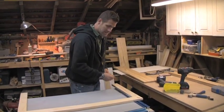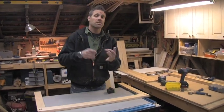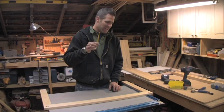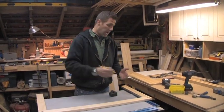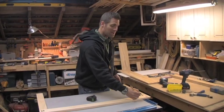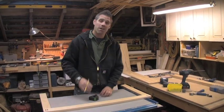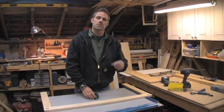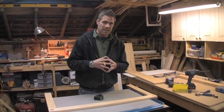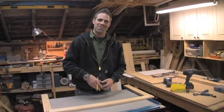The same thing applies if you're doing it this way as well. I've got an 18-inch style here. That 18 inches is 18 plus 3/4, your 3/8 on either side. Follow me here, you'll get it in a second. No, I lost myself because I was thinking. So it's 18 plus 3/8 and 3/8, 18 and 3/4. Then you want to take just a tick off. So then basically 18 and 3/4, so it'd be 18 and 5/8. That way you have a little bit of wiggle room. You got it? No, sort of? Okay, well you just email me if you have any questions.